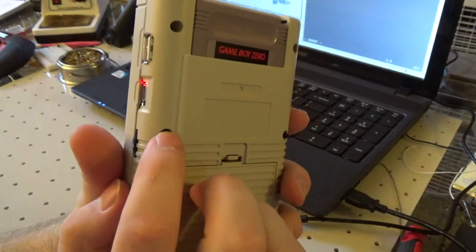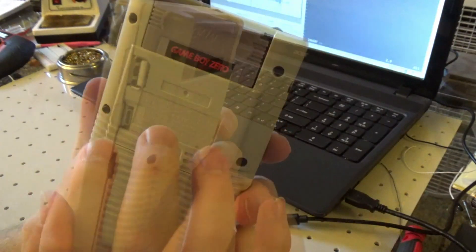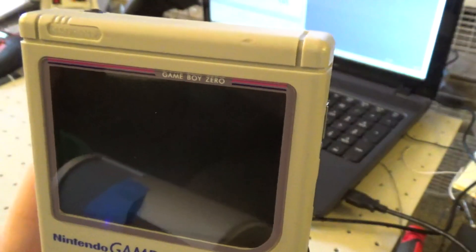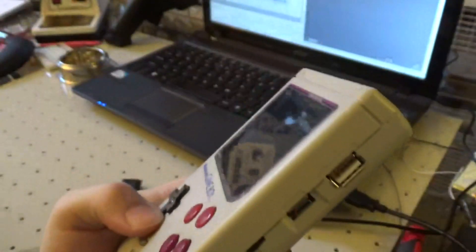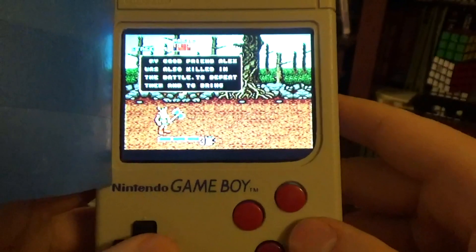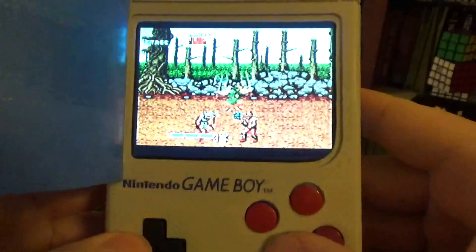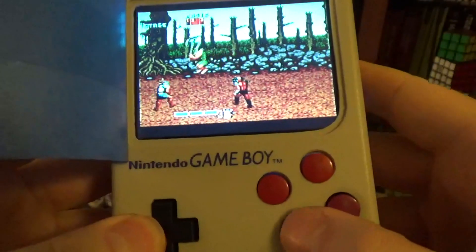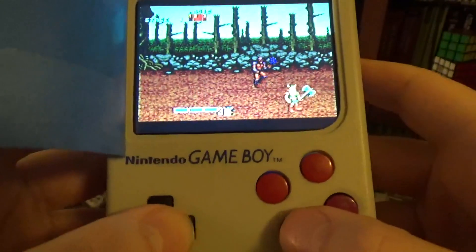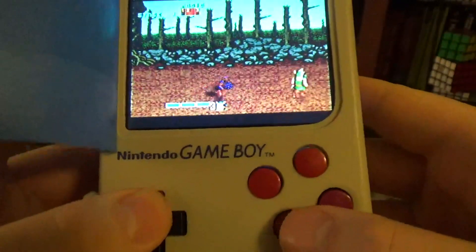There are L and R buttons — little tack buttons — added into the drill holes. The screen cover is custom-made from retrofresh.uk — I'll provide a link in the description. The button control is a custom passive PCB with button pads. The software I used to map that to the GPIO pins on the Raspberry Pi is called RetroGame, which emulates a USB keyboard, and you can edit the config file to map to keyboard controls.